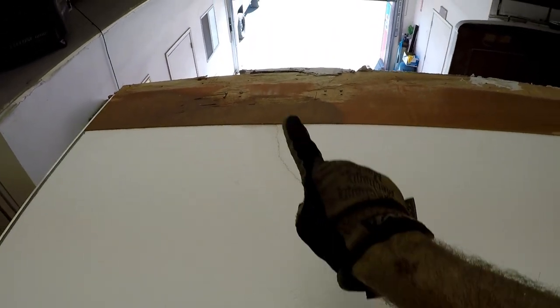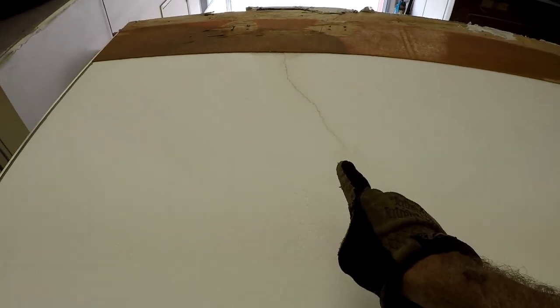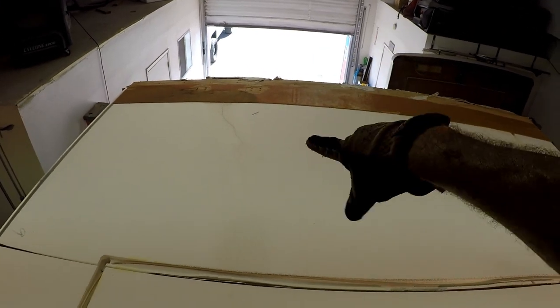Now, I don't know if I'm ever going to show anybody this, but I'm just going to document it just so that people know it wasn't me. So this crack right there, the ladder goes right here. You can actually see the ladder mounts right here. So all the times people coming up and down the ladder, they've been stepping right here. That's right where that AC duct is. So that's the weakest part. That's not a great place to put a ladder in hindsight. But when we put the new Luan on and the new Filon on, that'll actually give it a lot more strength.